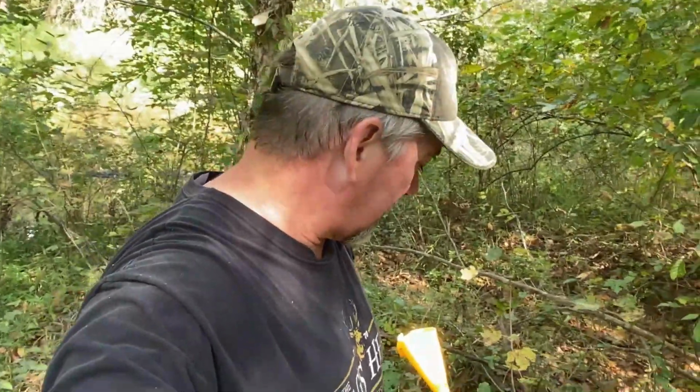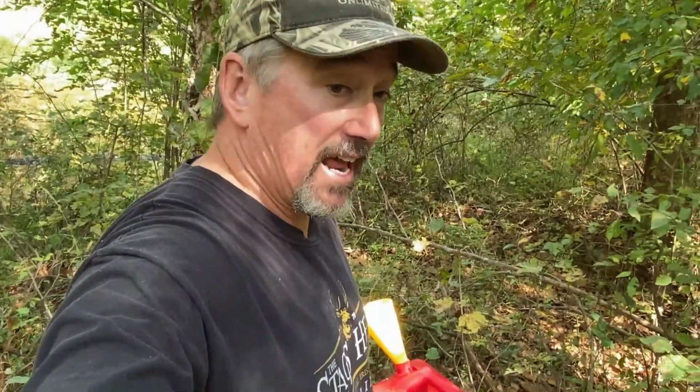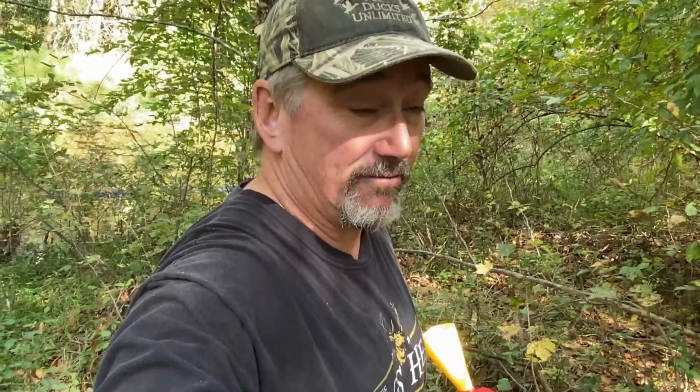But I started this guy at 9:30 this morning. It ran continuously until 1:45. So that's about 4 hours, a little over 4 hours, and still running. This was about half full. I just added a couple more gallons to it that I had. My math comes up with just under 10 hours of runtime. If I can get an hour and 45 off of the 0.9 gallon fuel tank, 5 gallons ought to give me like 9 hours and 45 minutes at full throttle.